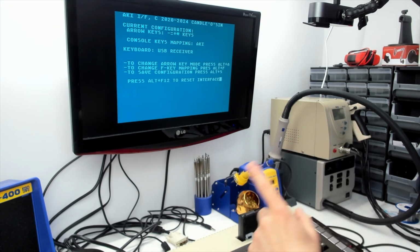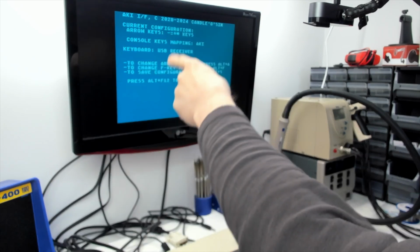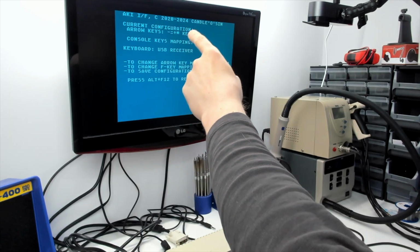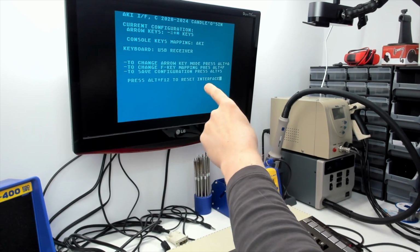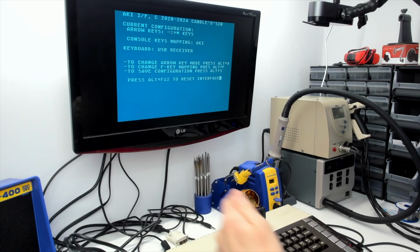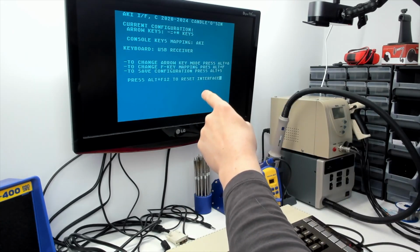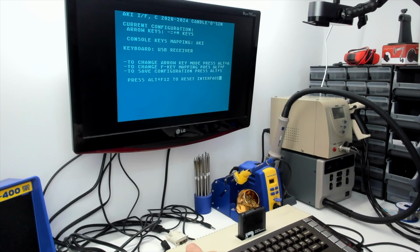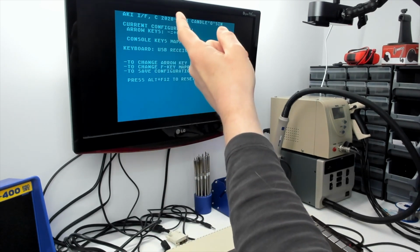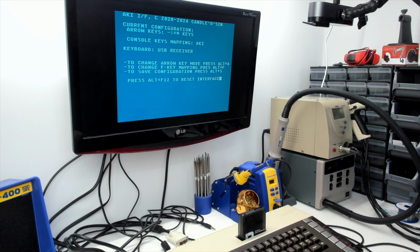And I'm assuming that's what it does, and it does that once at the top of the screen, on the assumption that the keyboard was probably in upper case, and it leaves the keyboard in lower case. So the next time we display the screen, the keyboard is in lower case, and it issues the caps keystroke at the top of the screen, thereby putting the keyboard into upper case prior to the next time the help text is displayed. I mean, I can probably verify this.